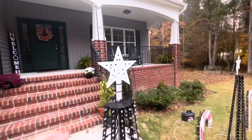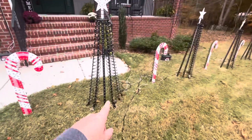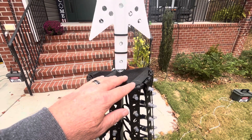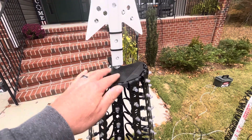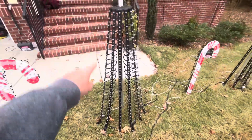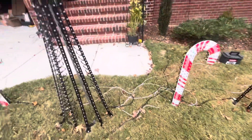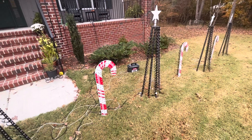I don't have any lights in the stars yet but I do plan on putting some in there. These are homemade — I made them myself. I have a 3D printed topper that I designed myself using SolidWorks, then printed it. Each strand has 25 lights, each tree has six strands, and the stars will have 20 lights each. The candy canes are all daisy chained together on one channel — 99 lights each, so 396 lights on that channel. It's starting to push it.